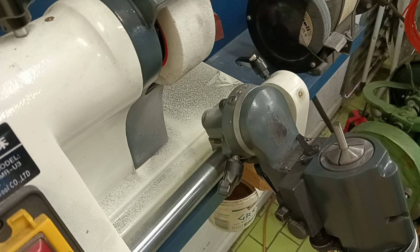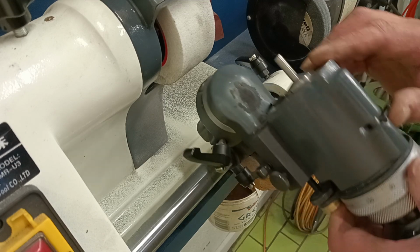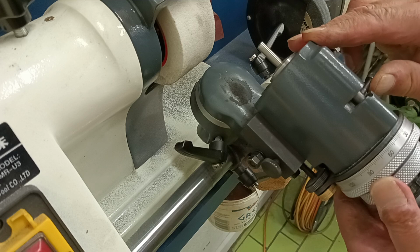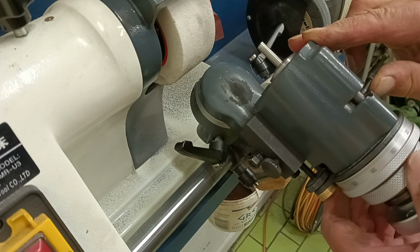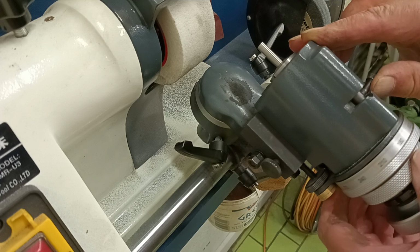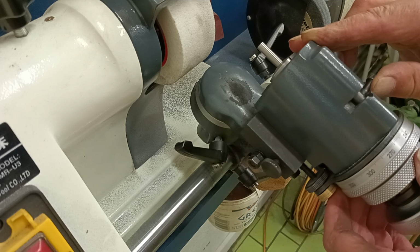I've done this one before in the pantograph, the dark art. I demonstrated this, but I'll just do this on a separate video just to demonstrate what it actually is. We're going to make a hexagon cutter. Now, a hexagon cutter just uses the castellations of this particular head here, and basically every 60 degrees, I drop that into its little latch points at every 60 degrees.